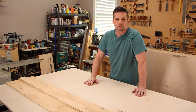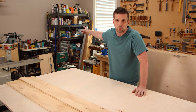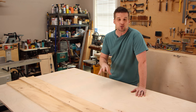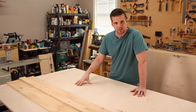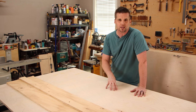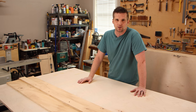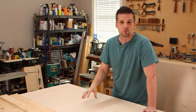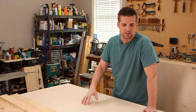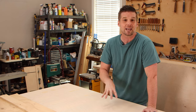The first thing I need to do is break down this plywood — cut all the pieces we need for the cabinet before we go over and clean that mess up and install the cabinets. You can build two upper cabinets, which is five feet total or 30 inches apiece, with three pieces of four-by-eight plywood — actually two and a half sheets, with half a sheet left over. I've also got a free plan for this project; there's a link down below, and in the plan I lay out all the pieces on the plywood so you can see how to cut them.